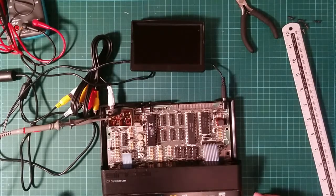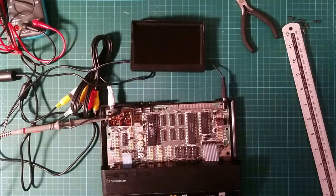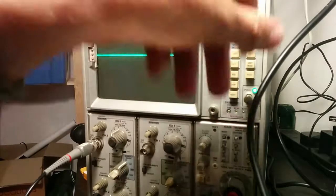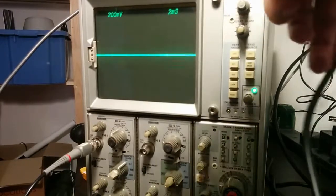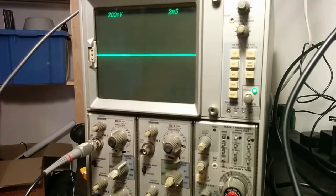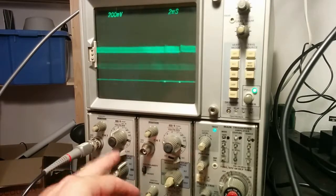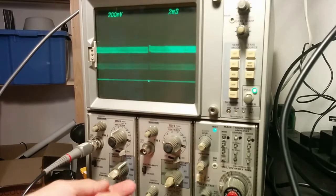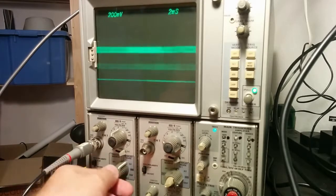You know, I really need to set up the camera so you can see this. There's no actual point to me doing this on video unless you can see the oscilloscope. So give me a sec and I'll give that a try. I really hope they've got on and off the right way around this time. Alright, here is my fabulous oscilloscope. You can only see about half the buttons because seriously there are a lot of buttons. Let me get this wire out of the way. That's actually the cable for the microphone. So, set this to AC and you can see we are seeing some signal out of the video port. And that's why it's not triggering.